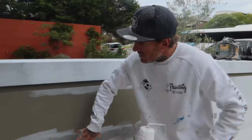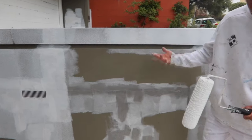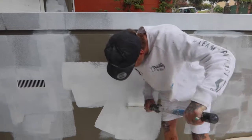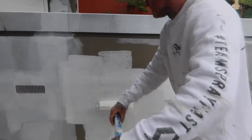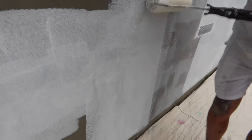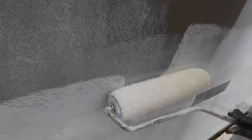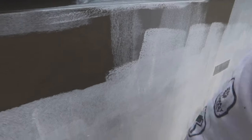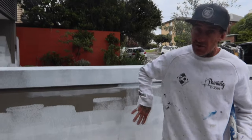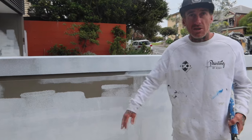I'm going through now. It's all been scraped completely and primed over the bare areas, then patched. Now we're just priming over our patches. There we go — we're pretty much ready to start applying our texture after this dries. I'll let this dry and then show you how to apply the texture coating over the top.